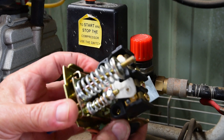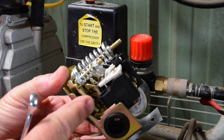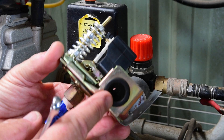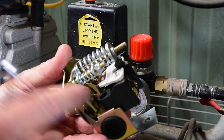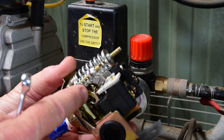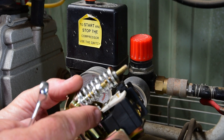In this video, I'm going to show you how I set one of these pressure switches. This is just a pressure switch that I've put an air fitting in, and I'll show you why I've done that in a minute. I want this pressure switch to operate this pump. I want the pump to come on at about 25 to 30 psi, but I want it to go off at 60. I don't really want more than 60 psi in this system.